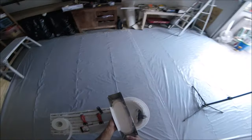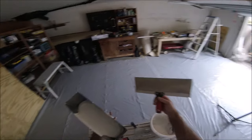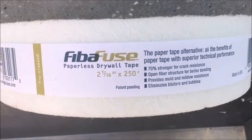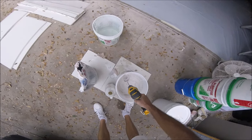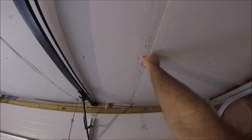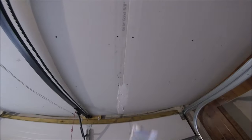This is a little unconventional, but it works for me. I'm going to put the mud on with a 12-inch knife and then bed it with my 6-inch. I'll be using FiberFuse drywall tape — it's a fiberglass mat, not a mesh — works great on drywall finishing. I'll also be using a quick-setting joint compound: a 45-minute hot mud made by Sheetrock called Easy Sand 45. I have more in-depth videos on both of those products — I'll leave links down below in the description.